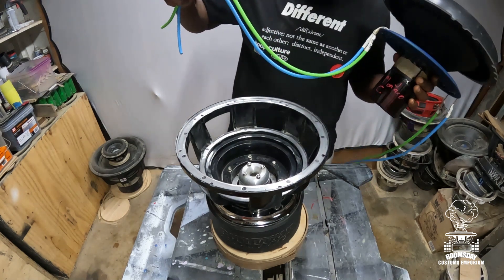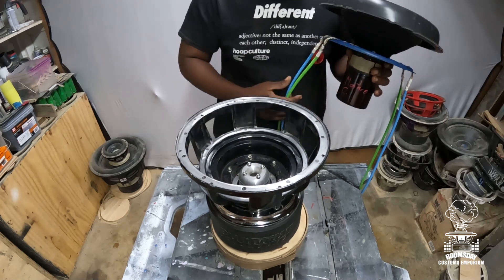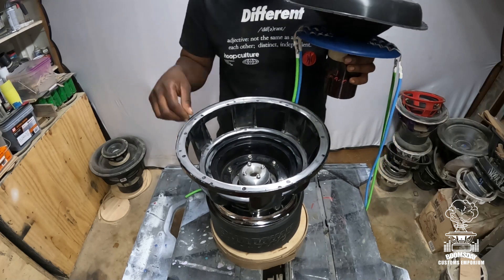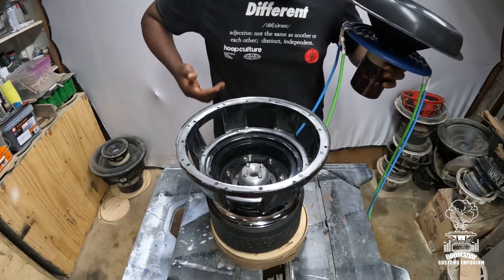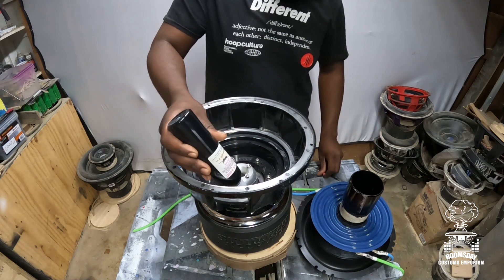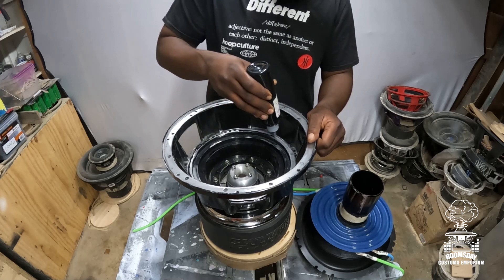When doing a recon with direct leads, you have to put the speaker wires through the holes in the basket. In this case the sub already had direct leads, so we're putting direct leads back in. When we put the bead of glue down, we'll have to hold it up until we get the direct leads all the way down into the holes to get everything seated properly. First, lay down a bead of glue on the spider landing spot — a nice even bead that's thick enough to mash in and get a good grab when it dries.